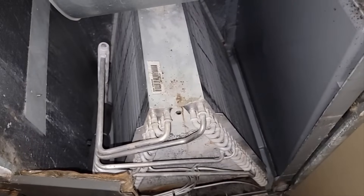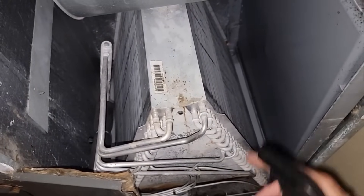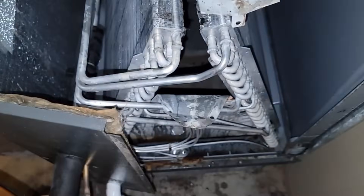Keep in mind that this is a heat pump. When you run this heat pump in heating operation, your indoor evaporator coil becomes your condenser. So it does experience high pressure during heating operation. And this outdoor unit, which is the condenser coil in cooling, becomes the evaporator coil in heating — so it would be a low-pressure area during heating, and the indoor becomes the high-pressure area.